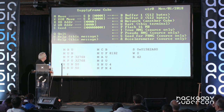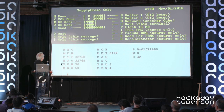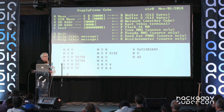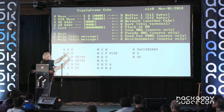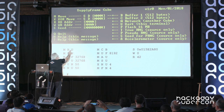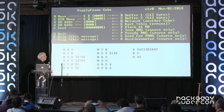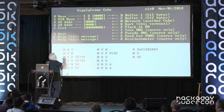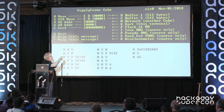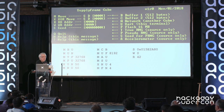There are two main commands. One is M for move, and another is X for XOR. For instance, when you type move, you are expected to type the source and destination. In this case, move from buffer to UART — you move from buffer one to UART. It's always performed on one block which is 512 bytes, and that is fixed — one block is 512 bytes. The contents of the buffer will be moved to UART, which actually is your terminal, and you will see the contents of buffer one with this command.